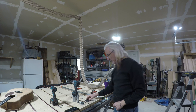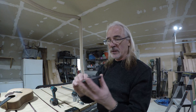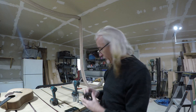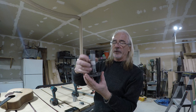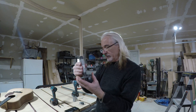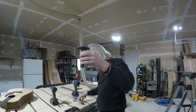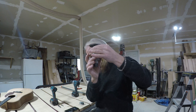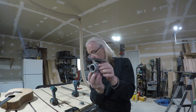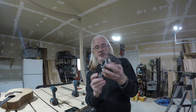The parts I've got here for this today: I've got a floor flange — a galvanized floor flange — that I'm going to mount on the ceiling. On that, I'm going to put this little nipple, three-quarter inch pipe, and that'll be attached on the ceiling like that. Then I've got a one-inch tee that'll slide over that three-quarter inch pipe, and then a cap on the bottom to keep it on there.